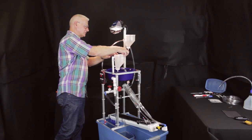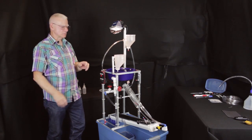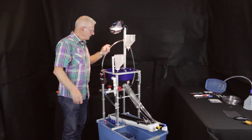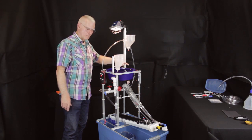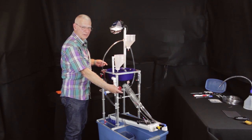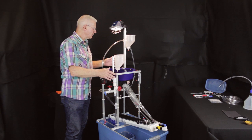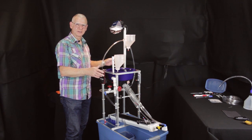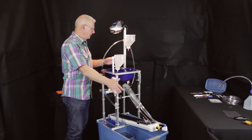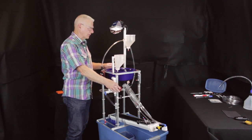There's our minus-30 hopper installed right there, and the only thing I'm going to be watching as we run this is the water line right over here on the back side. Once I set the water line and get it basically where I want it, I don't have to fool with the control knob anymore. This is not like an ordinary vortex bowl setup where you've got to spend all day long chasing the water. We went a long way out of our way to find these valves that eliminate that problem.